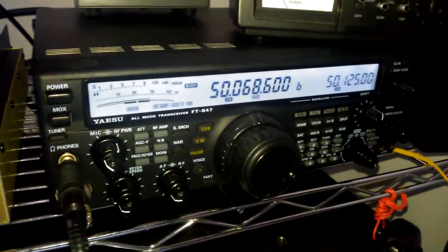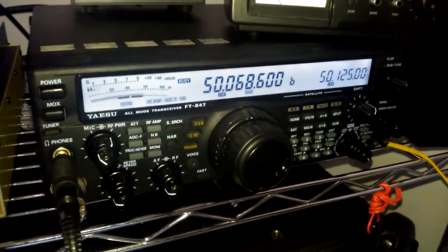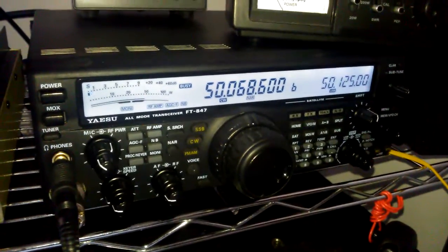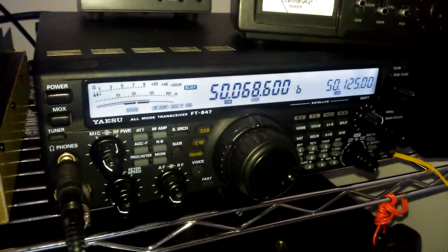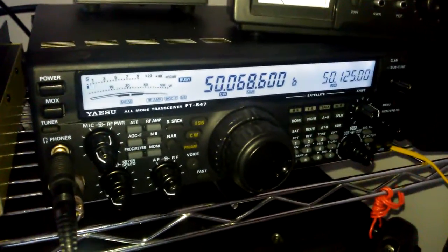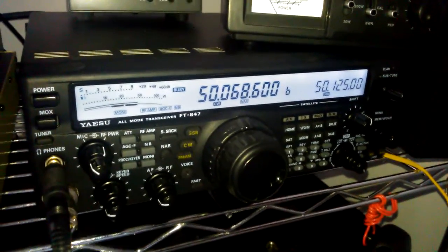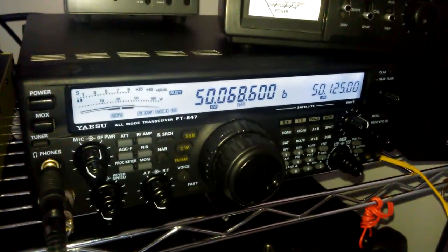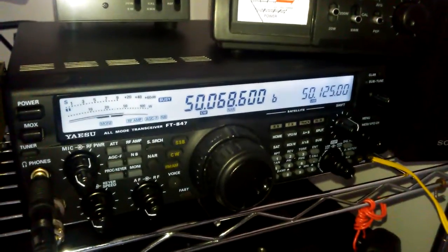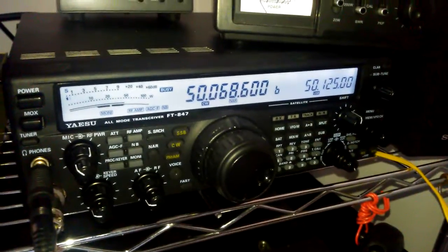The difference between these two antennas is the Moxon is, of course, larger, but it has 4 dB gain over the regular dipole. And the Halo has a little bit less gain even than the regular dipole. So I would say somewhere around 4.5 dB gain over the Halo.